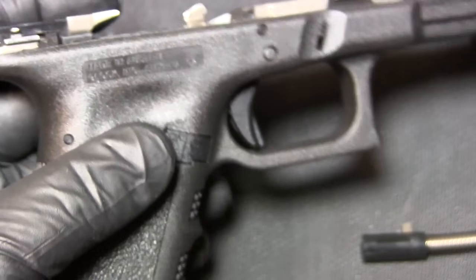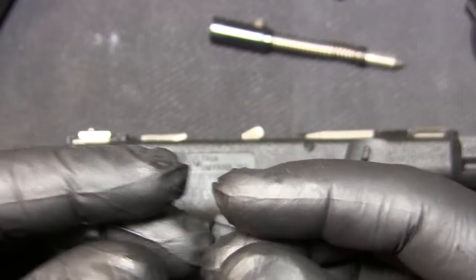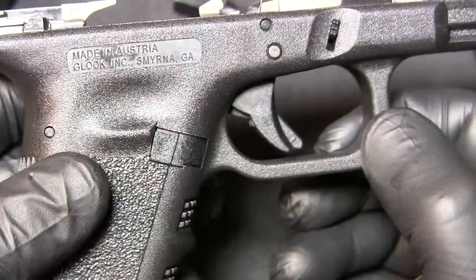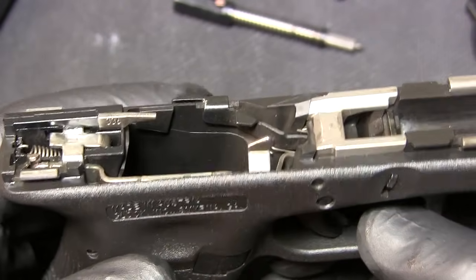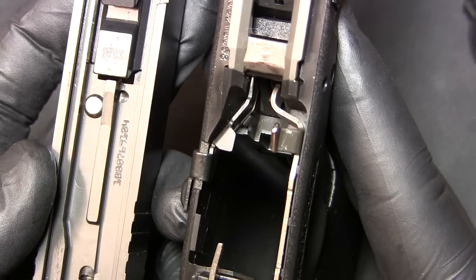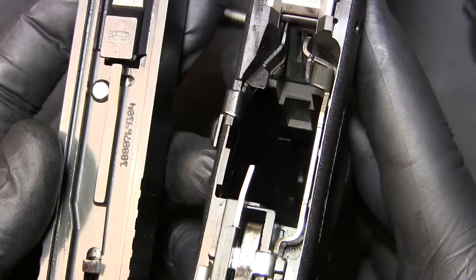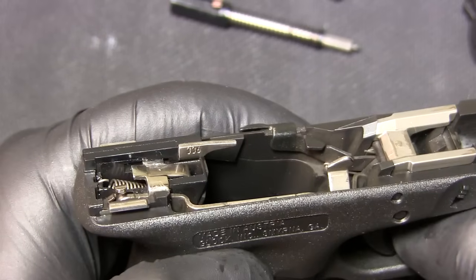What I did to overcome this was take my four-pound spring and, when it was off the striker, I stretched it slightly and then placed it back on the firing pin — and it actually did help apply enough force to extend the trigger all the way to re-engage the trigger safety. I hope this video helps you. I like to understand things, and hopefully I understood this correctly since I don't have the armorer's backplate and had to kind of eye everything. If I made a mistake somewhere, please correct me — leave comments, criticism, whatever. Hope this helps, thanks for watching.